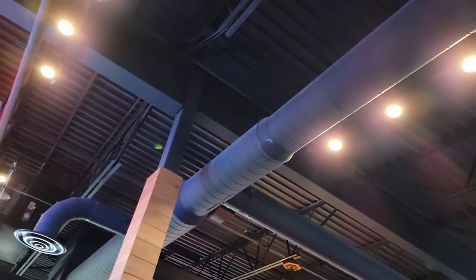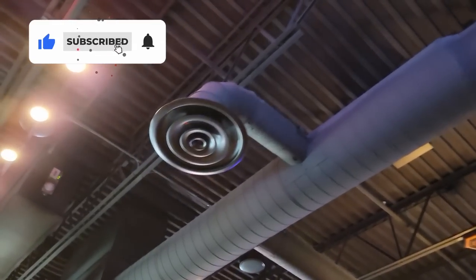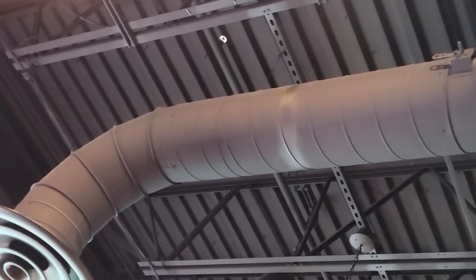So supposedly we got some condensation or something in here. We're gonna get up on the roof, check airflow, make sure that's correct, make sure filters are clean. All the usual suspects that generally don't change for nothing. So we've got ductwork coming across here to this main trunk line to there, and on back to that area there. So let's go up on the roof, see what we got.